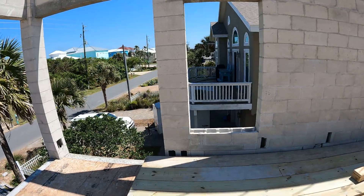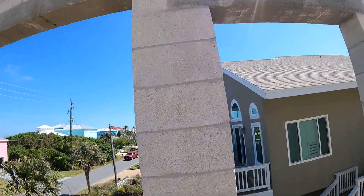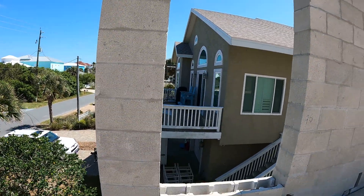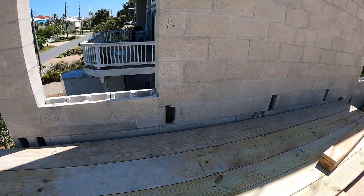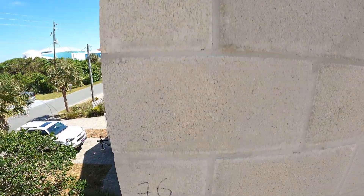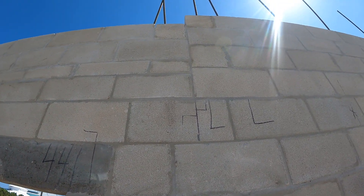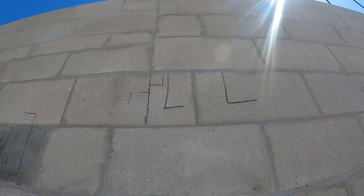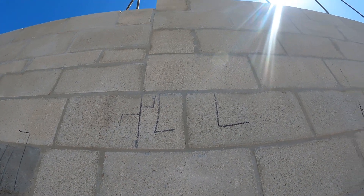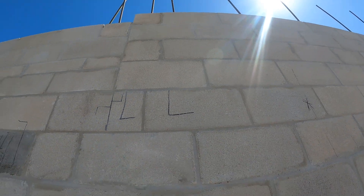Here is my opening here. I have two going from the foundation, first floor, tied in, going up here. And I have another one here, tied in, first floor, going up. I got the two over there. Got another symbol there and I got two pieces of steel rebar going up to the third floor.